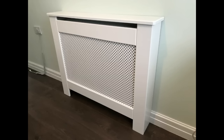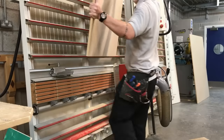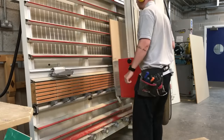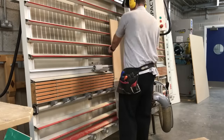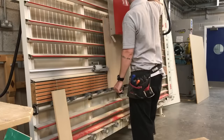In this video I'll be showing you how to make this simple shaker style radiator cover. The face frame and the sides are made out of 15mm MDF. I've got all the pieces out of less than half a sheet. For the top I've got an off cut of 18mm.